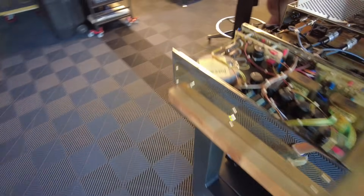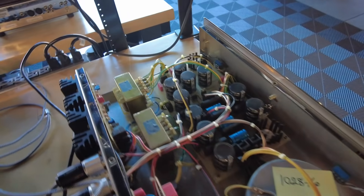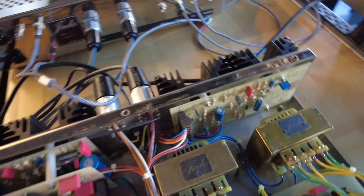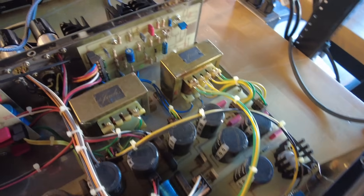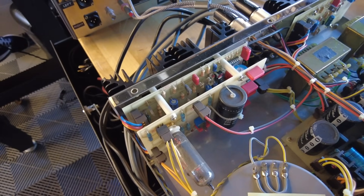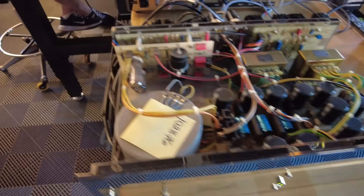Moving over to the test rig right now, we are doing a stress test on a Jody DAC — this is an all-tube DAC. Take a look at the build quality in here; this stuff that Jody makes is just fantastic. It looks like all of their PCBs are handmade to a very high standard. The power supply is a hybrid type design: it has a solid state power supply for the DAC, but all of the tubes are DC heated. The B-plus supplies the tube output stage, so you have independent power supplies for the digital-to-analog conversion and the analog output buffer.